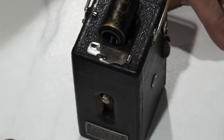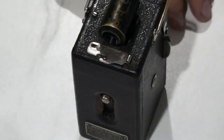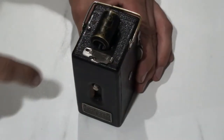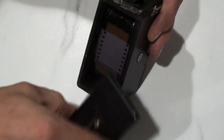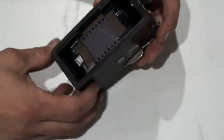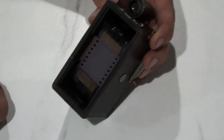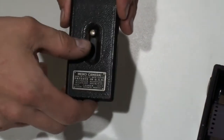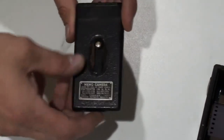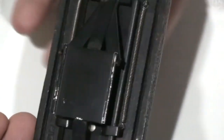I've just finished a roll of film with it. So what I'm going to do is open it up and reveal the inside of this camera, which is just as interesting as the outside. In order to open the camera you simply move the lever sideways and the back pops open. As you can see there's still some film — that's okay, I'm planning on advancing it back to the bottom cassette. I wanted to show you the mechanism used to advance the camera. It is mounted to the back plate and you can see there's a little pin which actually controls the slider — a spring-loaded slider.